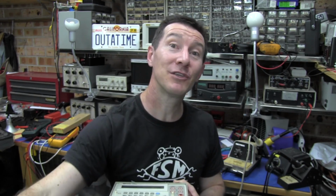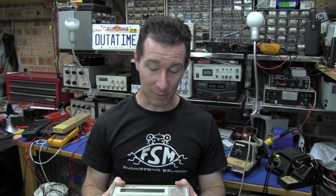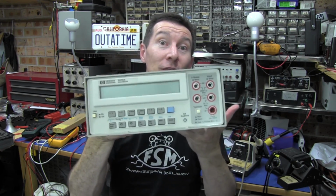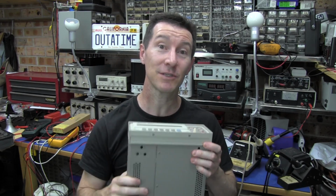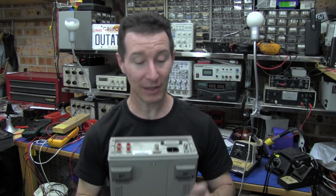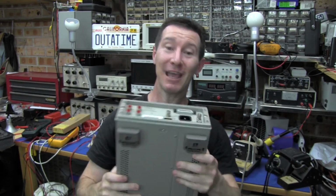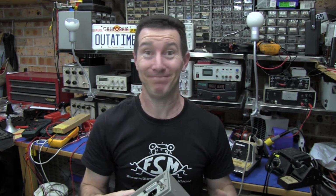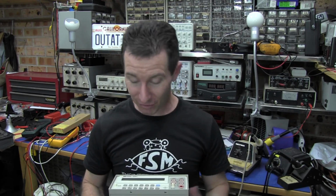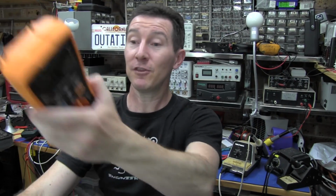The second part of it, we need to automate the actual measurement, or once again, semi-automate this measurement. Now, ideally, I'd like to use my HP 3478A, which we used last time, because it's the highest precision, highest resolution instrument I've got in the lab here. But unfortunately, it's only got an old school GPIB interface, and I don't have any GPIB cards anymore. I've probably got an old ISA card somewhere, but I don't have a computer that has an ISA port anymore.